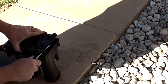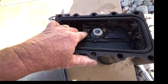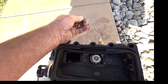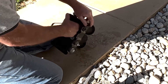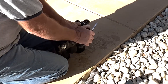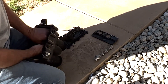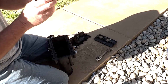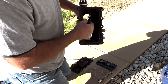As you can see, when I finally got this thing open, there was a ball of calcium. There was a bunch of calcium all inside this manifold — a pretty good wad — and for a minute I thought that's got to be the problem. You could just hear it rattling and popping in there. But typically when we have a heater that rattles and pops, the problem is actually the bypass valve, which is what I'm working on getting out. That's your spring, that's your thermal regulator. It looks like it's actually working like it's supposed to — it's all one piece.